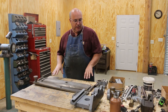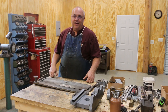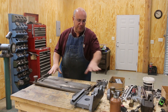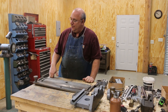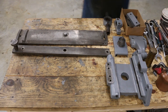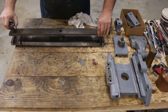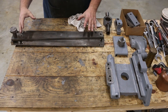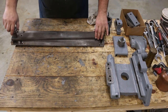So I'm going to wipe this down really good, make sure I don't have any dust or dirt, get these positioned apart from one another and oil everything down really good. Get these bolt holes to line up — there's one, there's the other. Now I've got these little nuts, I'm going to get those right over the holes and get them started, one on each side. We got that on there, now let's go ahead and tighten it down. So up next we're going to start working on the taper attachment. The taper attachment, of course, is used for cutting a taper and you can adjust an angle on here with this little cross rod that pivots in the center.